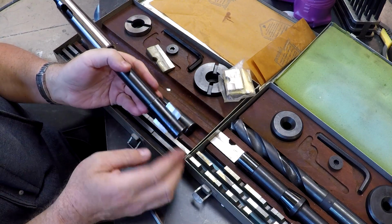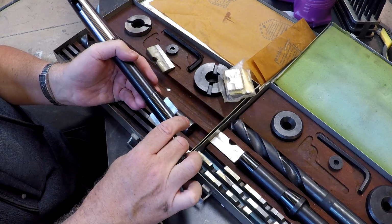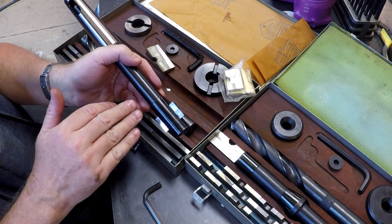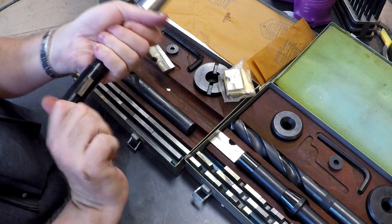So there you go. You drilled 1 inch. Then you can take this piece here, pilot off the inch size hole, and then you could drill the 1 9/16, and you're done. Okay, that's if you're going to go one step, right? If that's the biggest hole you want to do. But what if you wanted to drill something bigger?